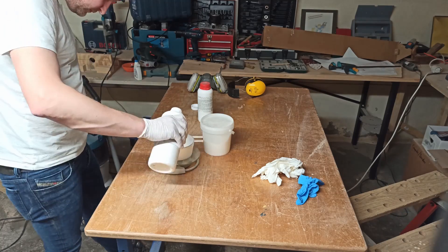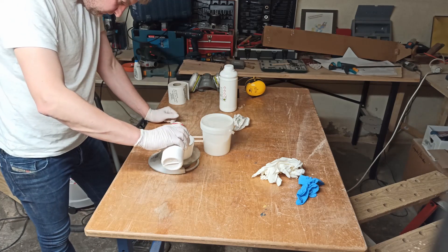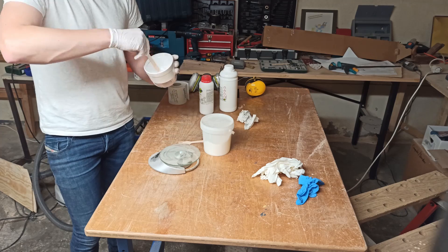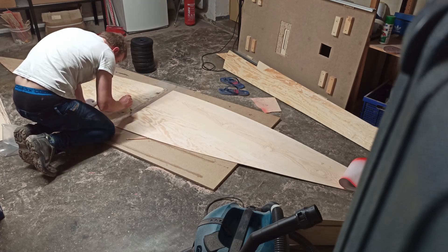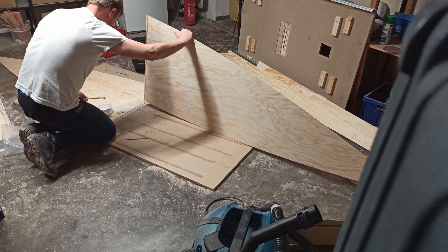Scarf joints are glued with epoxy. I used a similar product called Greenpoxy which consists of 27% natural resources. The epoxy was thickened with cotton fibers to prevent it from flowing out of the joint. The consistency of it should be like creamy honey. I put a non-adhesive foil under the joints and covered both sides of each joint with the epoxy paste.